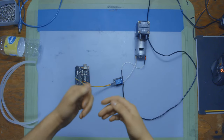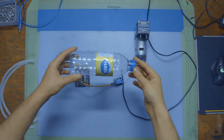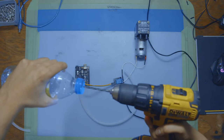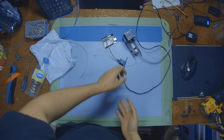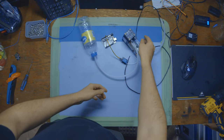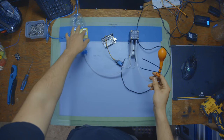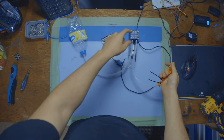Since this is a video and you can't interact with what's happening, we're going to use a water bottle for a physical demonstration of the vacuum pump. I want to make a hole in the bottle, stick the tube inside, and glue around it for a tight sealed fit. We take the bottle and connect it to our pump — air coming from the bottle into the pump, then out to the exhaust port. I also take a balloon and put it on the exhaust port. You can see that when I push air out of the bottle it fills the balloon, and when I try to push air back from the balloon into the bottle, the one-way valve stops it.